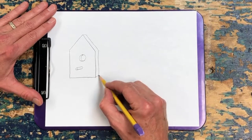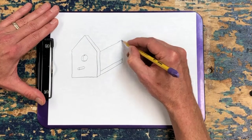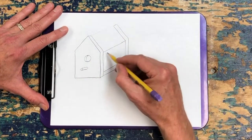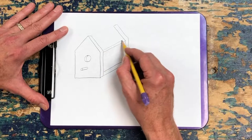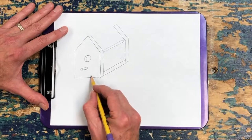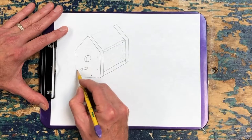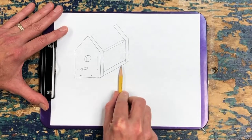The base is going to go behind the front piece and extend out the back. And then in the back we're going to have the same piece as this. There's our side piece and that has some width to it. The bottom piece is going to be hidden inside and there's going to be a couple of screws in front to hold it, and a couple of screws here and here to hold the sides in, coming in from the back too. There's also going to be some screws that go up from the base into the sides.